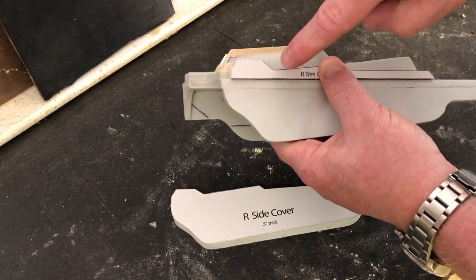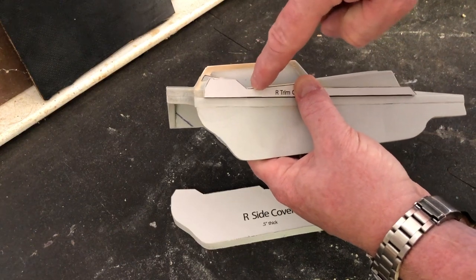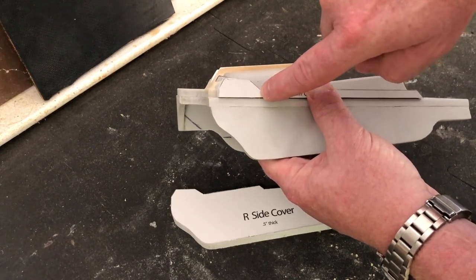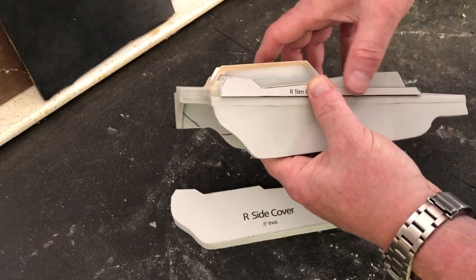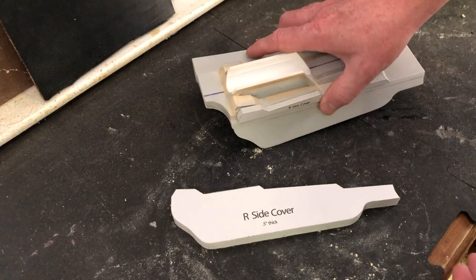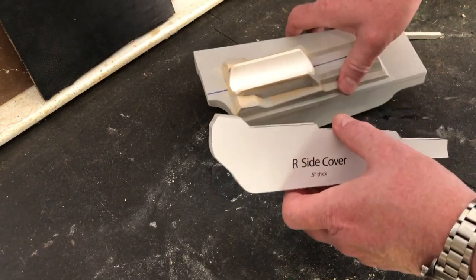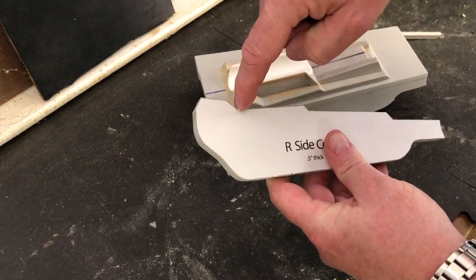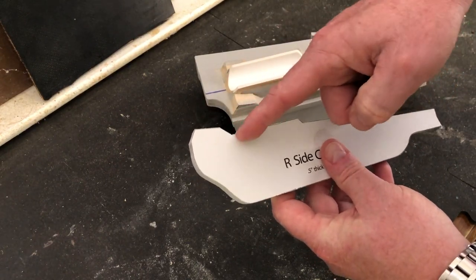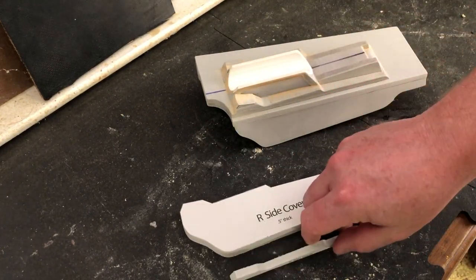In this case my piece is too short, so I'm basically just going to cut it right here where this angle meets this angle - that little juncture right there - and push this back. After that we can go ahead and fill that piece really easily. I'm going to do the exact same thing on this side and cut this at a 90 degree angle to this edge, straight down. Let's go ahead and mark that and do it.